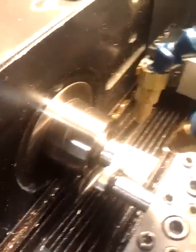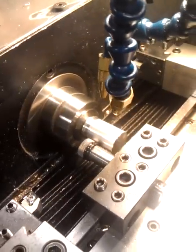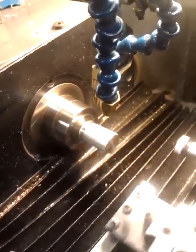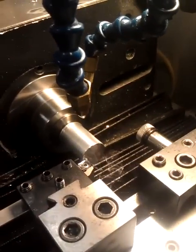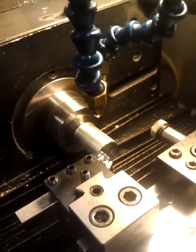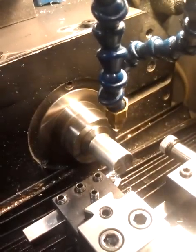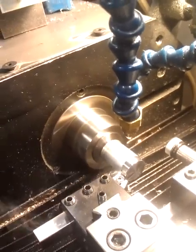Almost there — it's going to back off and come away. Z01 comes back. It's going to re-face it, just put a thou — yes, a thou is .001 — off the face. I'm going to face it, put a radius on it, and then undercut all that knurl off the front, lightly kiss that second part of the knurl to make it clean.